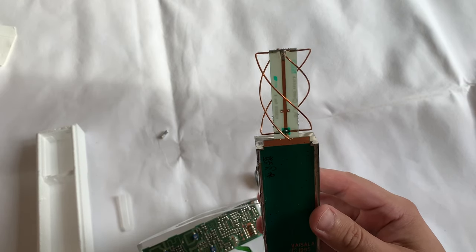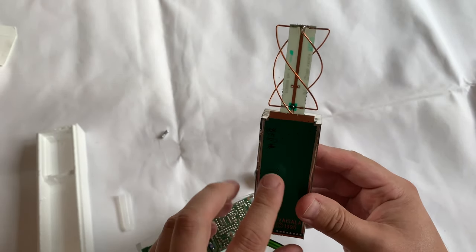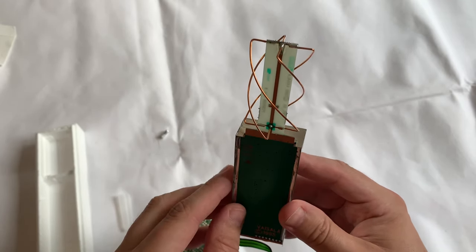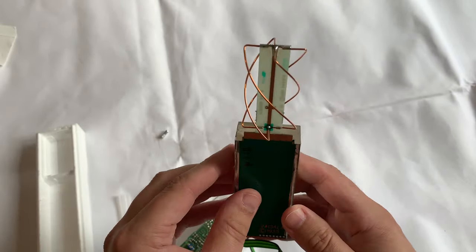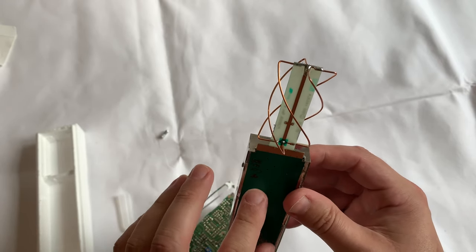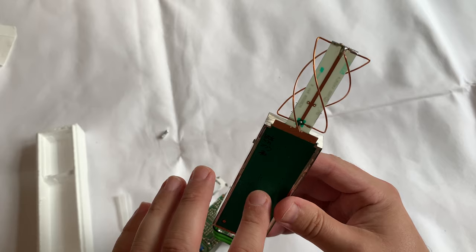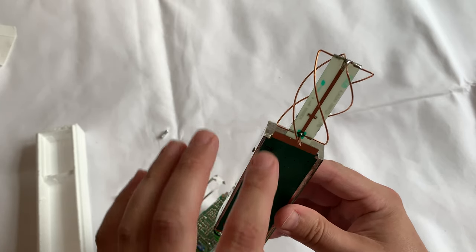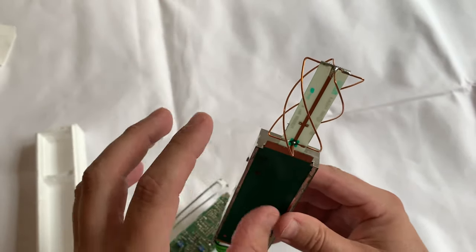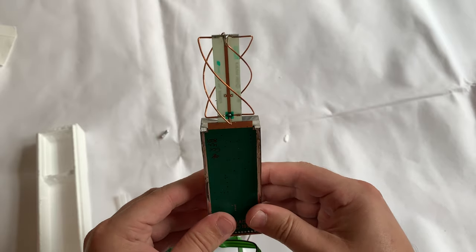And I thought, this antenna here is a GPS antenna. Now, I'm not really interested in the electronics inside this. It's just this antenna here, because this should be pretty good for use on the L band, so we're talking Inmarsat and maybe even Iridium. I probably could look into the electronics here, because I'd imagine there are some filters or something on this board for filtering and amplifying the GPS signal. But I'm just going to be using the antenna, and I'll probably use it with some new LNAs and SAWbird filters.